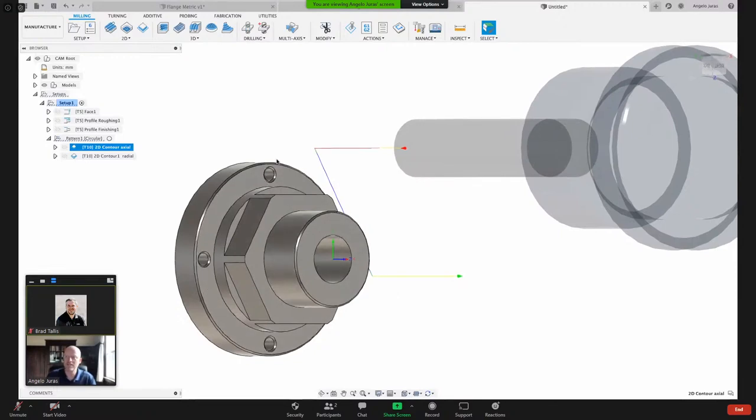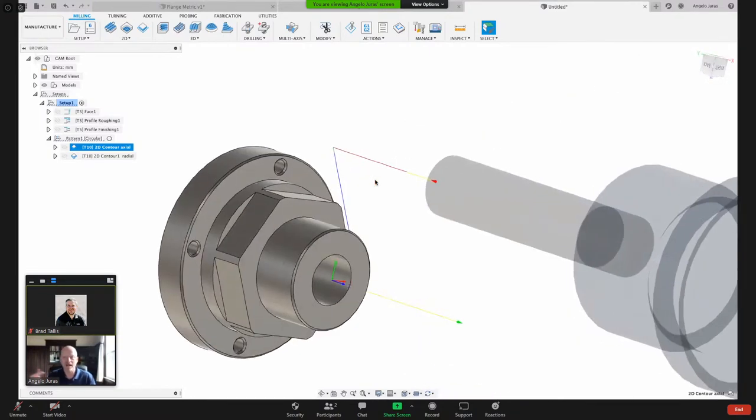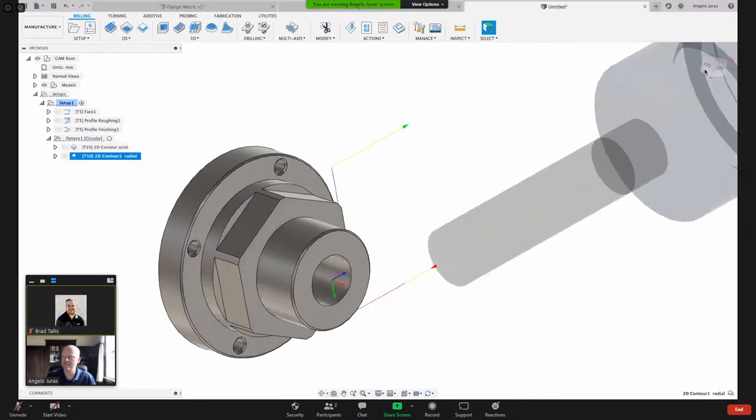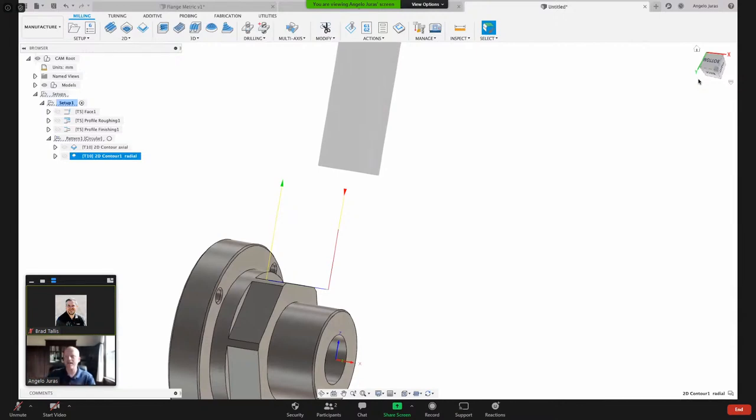So if you have a machine that does not have a y-axis, you'd want to cut these flats with the tool in the axial orientation. If you want to use the radial orientation like this, then you would need a machine that has a y-axis, so that when you're looking at it on the end here,